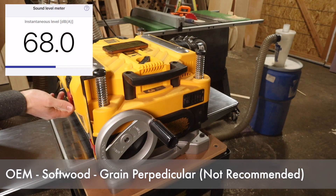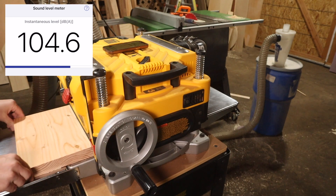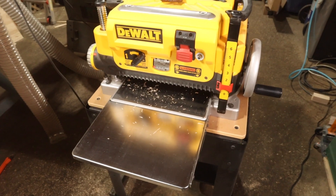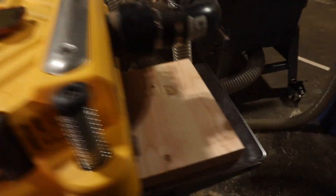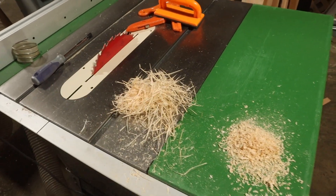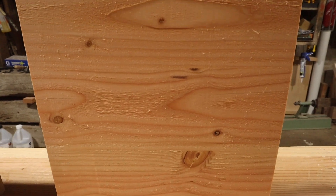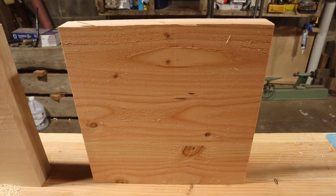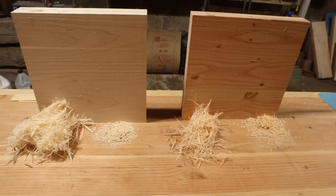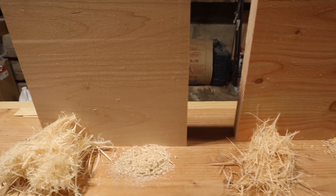Now running the softwood perpendicular with the OEM blades — again, not recommended. Not bad, very similar to the maple. A little bit of fine stringies in the front, basically nothing on the back side, but looking at the sawdust we get a lot of stringies again. I'm just lucky the dust collection system didn't clog this time. At first glance tearout isn't that different, but the pulpier sections show a lot of tearout and it really started to peel apart right at the grain lines. Overall comparison with the OEM blade — softwood on the right, hardwood on the left — chip quality and tearout seemed about the same in both tests. Just kind of awful on the whole.